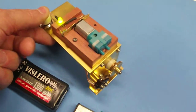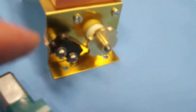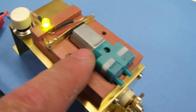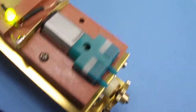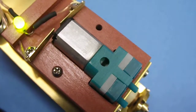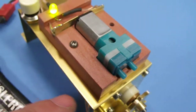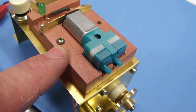I devised this little unit here, which employs the motor and big gear train here to turn a cam, which operates a mechanical switch. The switch in turn sends a pulsating DC at a very, very low frequency to the motor. So what I have is a start and stop situation, as you can see inside the motor wash plate — it's a jerky operation. We're starting and stopping the motor and over time, we're going to cover every point that the brushes would fall on the commutator.